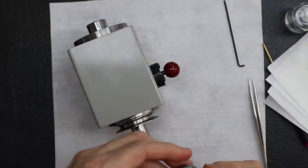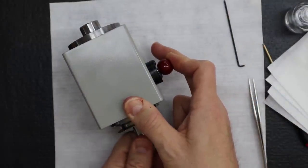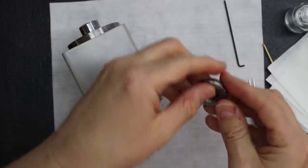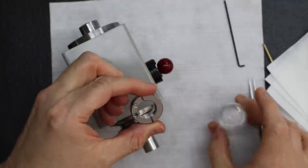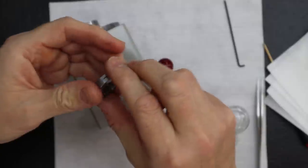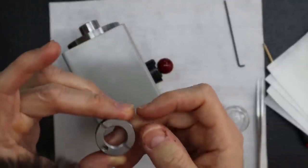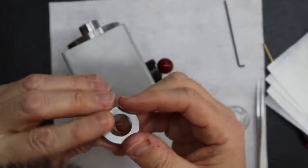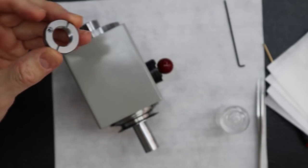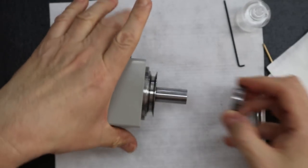That was really nice. Sure is looking nice. Okay, at this point, I'll lock. There. Lock. That's nice. Now I'm going to lightly oil my spindle nut. I'm just making sure it looks good, no foreign particles or anything. It's just applying direct pressure equally all the way around when it goes up against that pulley.